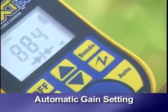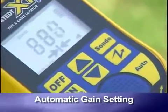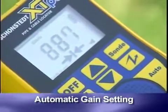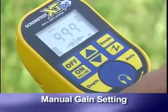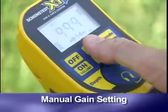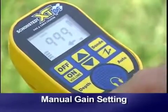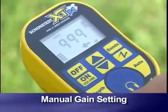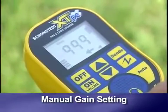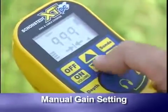On the XTPC, the device uses automatic gain mode as a default when turned on. Use the up or down arrow buttons to set the gain with the receiver directly over the targeted line. Use the gain control and use the signal strength indicator as a guide. The gain should be set to the lowest setting that still shows a clear peak over the trace path.